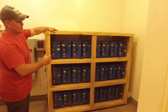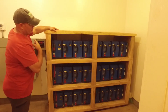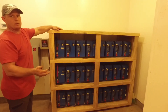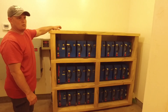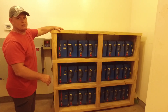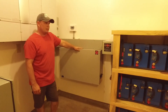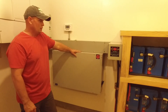One other thing we did differently this time — as I've learned more in the off-grid world — before, we had the three strings wired at 48 volts, paralleled them all, and ran dual feeds back to the inverter. What I'm going to do next is add another inverter so we can make the hydro system more efficient and parallel the hydro with the 14kW inverter. I wanted to run each string of batteries with independent battery cables and breaker-protect them all, so we added the Midnight battery enclosure. This is a great addition for larger systems or systems you know you're going to expand on.